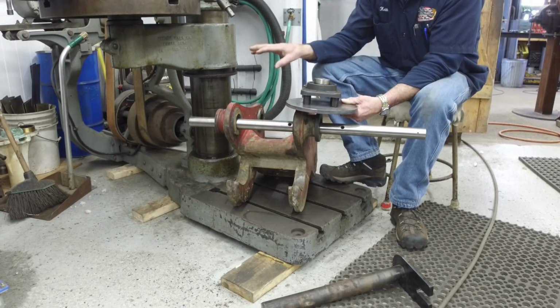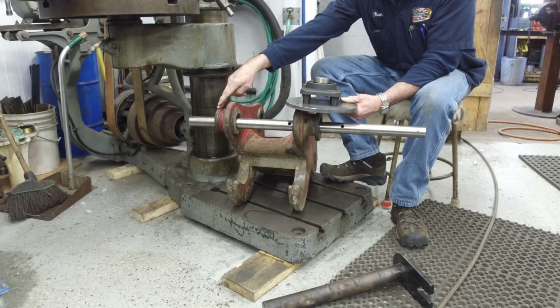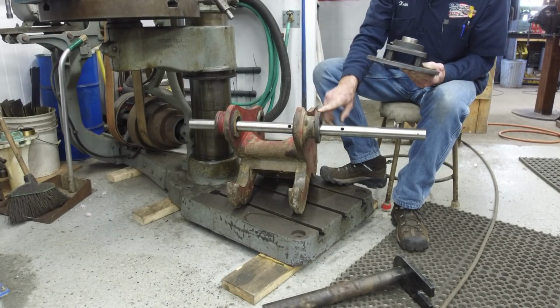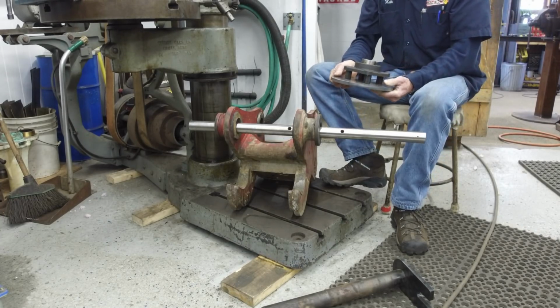and we can mount these bearings perfectly in line with the bore we're working on, because that diameter is good and it's centered with the bore, and this diameter over here is good with the bore. Has a little burr on it. We'll have to do a little bit of dressing, manipulating that surface to be burr free.